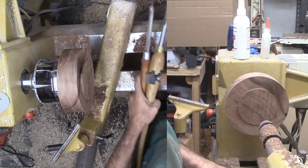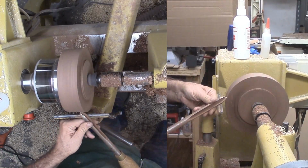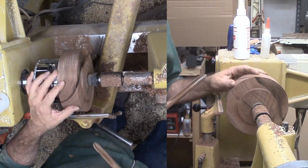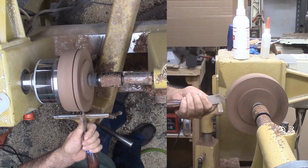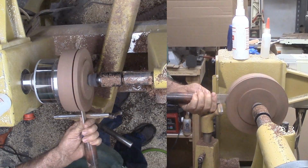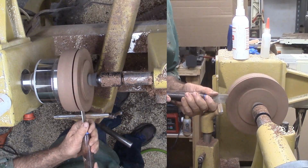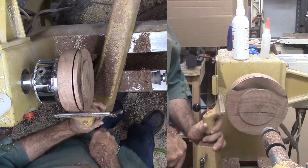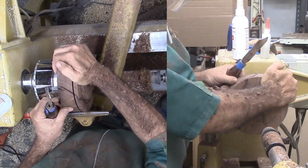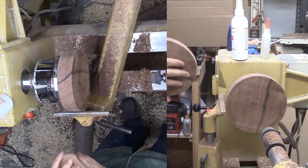Before parting off the lid, I'll flip the wood around again. I could leave it there, but this orientation helps me visualize the split better. Parting this diameter of wood was tough. Cutting the gap wider than the tool helped, but I really needed a longer parting tool. It got tough hanging over the tool rest as far as I had to. Finally, I broke off the final little bit. This is cross-grained, so it finally snapped easily. I'll stop now and treat the cracks liberally with CA glue.